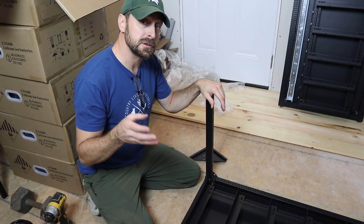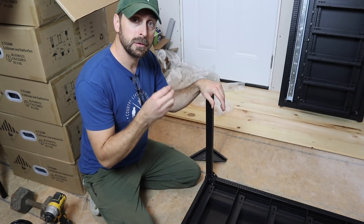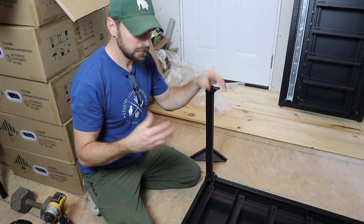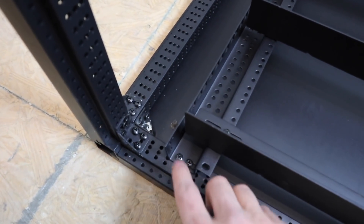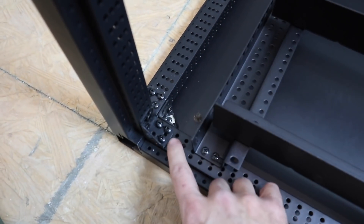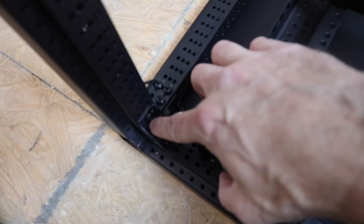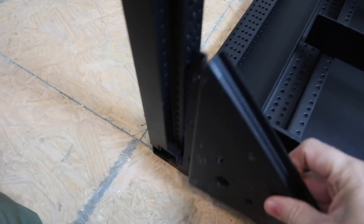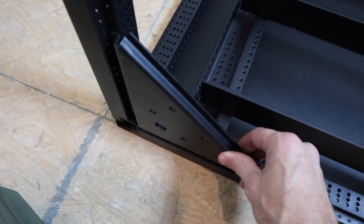Signature Solar is very helpful when it comes to things like this. If you call them, they'll email you a series of instructional pictures showing you how to put this together. But if you just watch this video we'll get everything done for you. Let's start with the cross brace. You can see the frame here has a lot of different holes in it and that is going to line up with the holes if you put the proper cross brace in each corner. You can get four screws in it on one side, four over here, and then you have to move the middle screw out on each side on the top and you can get four in that side. They have some corner bracing which is great — that will make the whole thing very rigid.